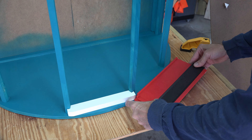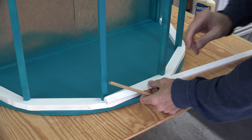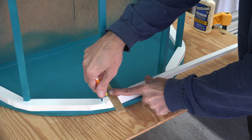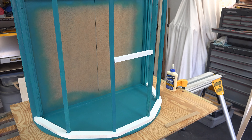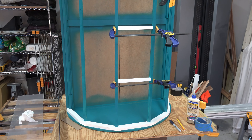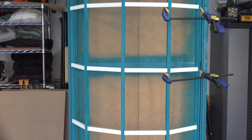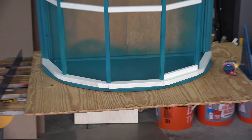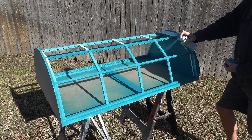Seeing that this worked great, I just continued with the rest of the panes, simply repeating the exact same process for each. Starting at the bottom, I began cutting the cross bars for each window square using the same composite plastic scrap pieces. I took a straight edge, held it on each piece, and drew the lines so I would have the exact angle of each piece. When cutting, I would cut a little bit larger and then trim it down to make sure each piece was perfectly snug. I continued with this process until all the frames were cut out. Remember that the person requesting this window wanted shelves inside, and in order to access them, I would need to make a door so she could get inside the window. I'll hide it in plain sight as part of the window panes — the far right pane will not be completed during this process; we'll circle back to that later. I took the window back outside and painted the cross bars of each window pane.